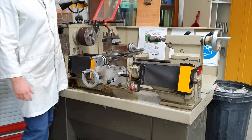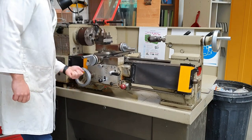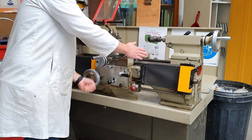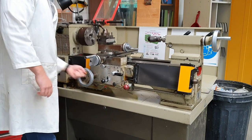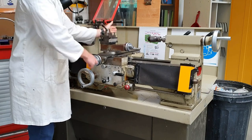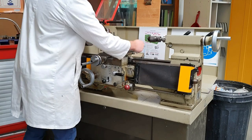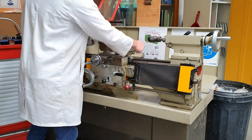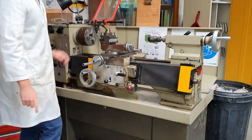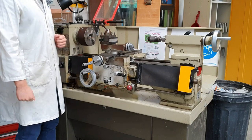So I've mentioned the chuck and the chuck guard. Now we've got all these handles here. This is the carriage, which moves the whole assembly across the lathe bed. We've then got the cross slide, which moves it back and forth in this direction. The top slide moves the same way as the carriage but gives you much more precise and controlled movement. We've then got the tool post, which can hold our different types of tools — we'll be talking about those in the next video.